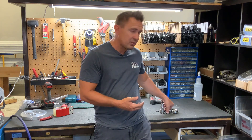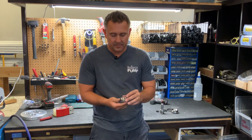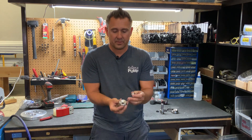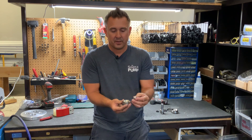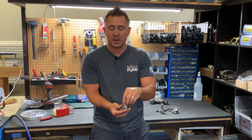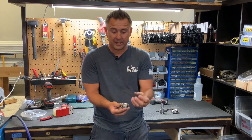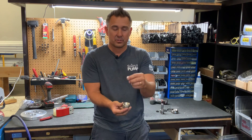If you look at our 125 cylinder, which is very common — probably our most common cylinder — the bottom check valve, as you can see here, is a ball and seat. We've got a very finely machined seat in stainless steel and a stainless steel ball. When you're not pumping, this ball plugs that hole, and that's what holds prime. It's also what releases when you actuate the handle so that water can come up into the cylinder and be pumped up.